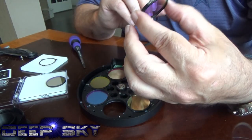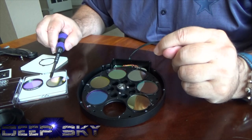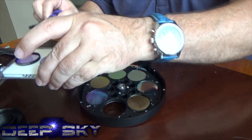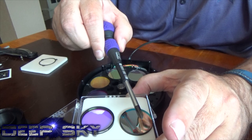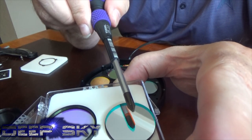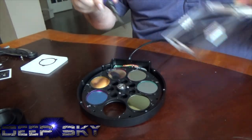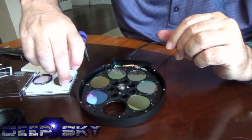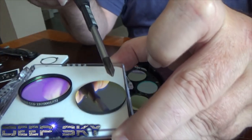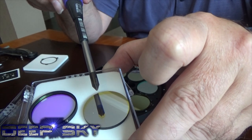I had it in the sort of upside down position. Now I'm doing the reflection test on this, and what I'm noticing is that I see a double reflection of the screwdriver. I don't know if you guys are able to see that on the video. As I put this screwdriver over the top, there's a double reflection in there. That indicates that it needs to be pointed in the downward position when I put it in place. So I'm going to turn this over as delicately as I can, trying not to touch it. Let's do that test again. Now in this case, I do not see that double reflection. So this is the side that goes up — this is the correct direction.